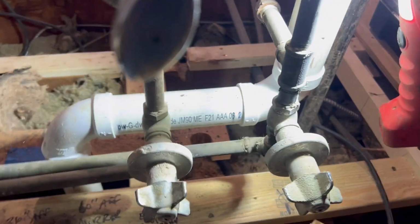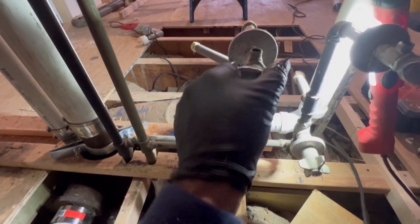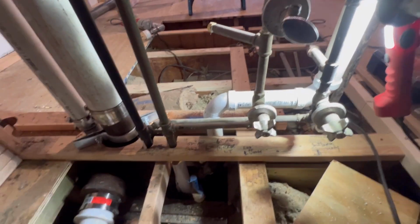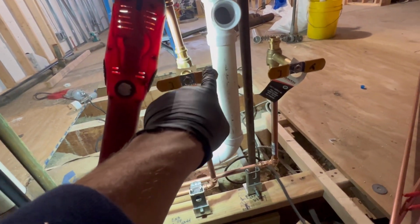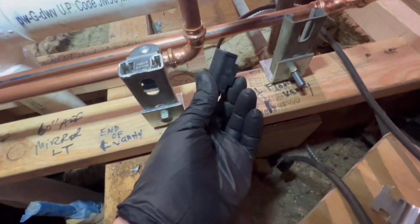So we got the water off. And we're going to make 2 cuts. Boom and boom. And start roughing in. Here we go. Let's get to it. All right, guys. We're roughing in the waters now. We got our 1/2-inch long stem tile stops that we're using. But guys, I want to show you these insulated Kindorf clips, man. They are great. Insulated Kindorf clips.